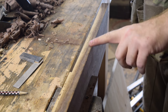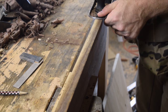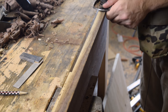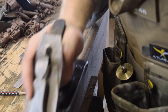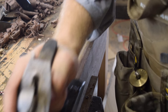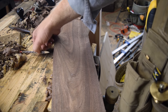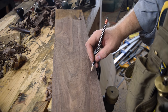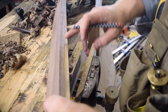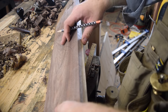If you want to take the high side down — my high side's over here — just try riding your finger on that side of the tote. That'll take a slightly favored shaving towards the side your finger's on. Now we have our face flattened and one edge. We want to mark it so we can keep track of where we're at, so I'll put a cursive F right here and right here — marking this as the face side so we can make all our measurements off this.